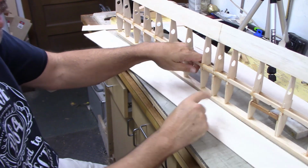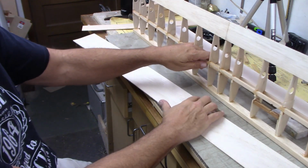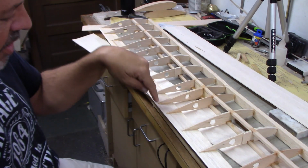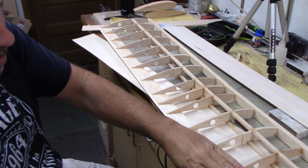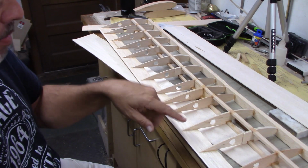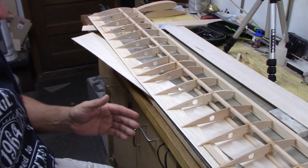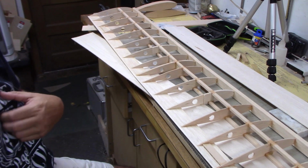So let's go ahead and do that. What I'm going to do is come in and sheet, and you'll see it on the GoPro, I'm going to sheet the top side on the back part here. And then I'll make my marks where I'm going to have to eventually cut this out, because when you're cutting the ailerons out, it's very strange the way the plans are,